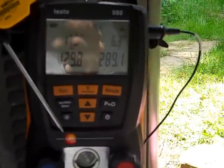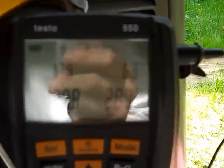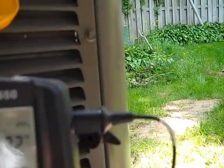We're just about done. The reflection on the screen is a problem. Let's get back to the superheat/subcooling reading. We're getting our subcooling close to six now. I just made an adjustment, so it's going to float around for a little while while the TXV does its thing. Subcooling is about six and superheat's down.